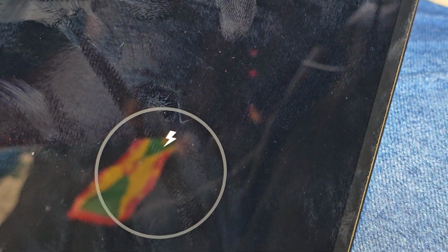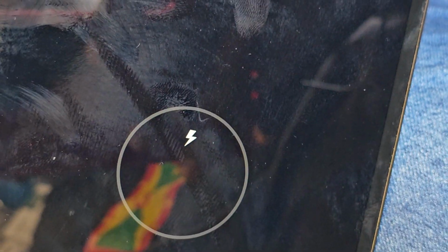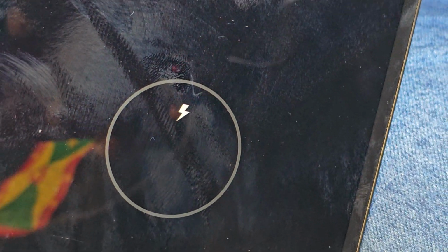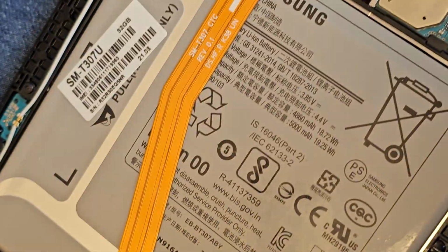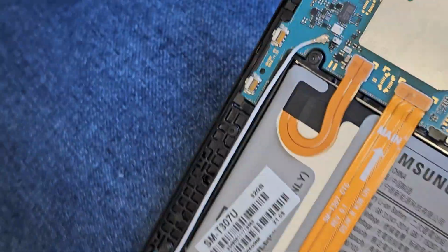So that's it. Now I know other persons may use other options or other methods of changing the physical charging port, but that is basically what I would do to resolve this problem. I say the person may not, they just want to get the data out, but the port should be fully functional in the future for usage. I would clean out the damaged areas, clean this up with some isopropyl, clean the speakers out, and put this back together.